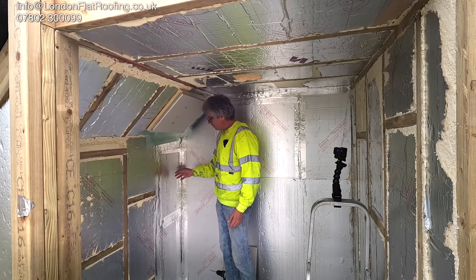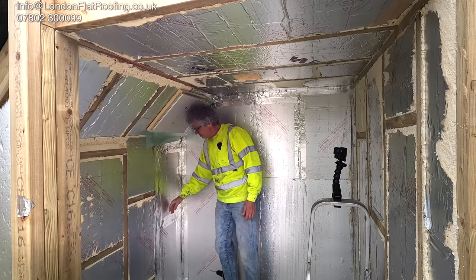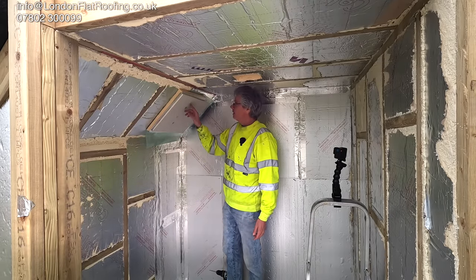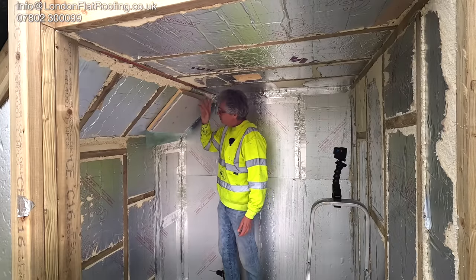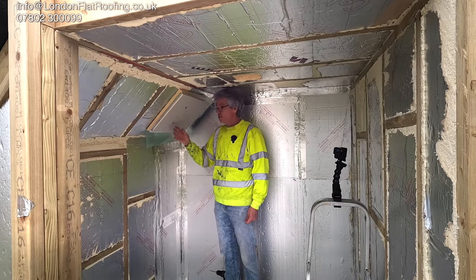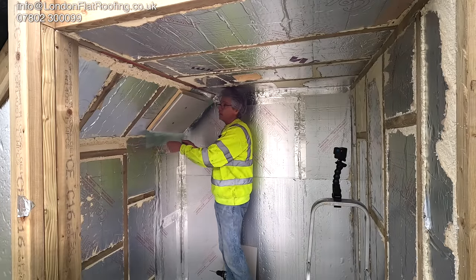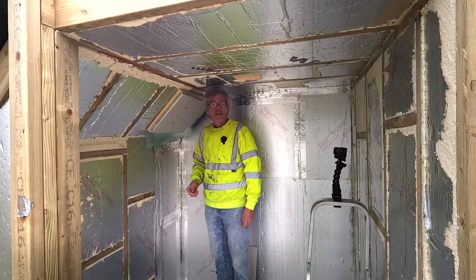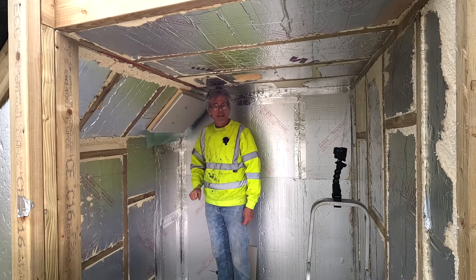There are too many problems with it. This was done two or three days ago and I'm seeing that this is still loosening in places all the way around — it's just not airtight. Now when I take this off, you'll see that there are screw holes going through breaking it, and that causes a problem with air movement as well. You'll see when I do the next video — which will have the vapour barrier continuous all the way around — how we get around that problem. So hopefully that's been helpful for everybody out there. If you've got problems with this kind of thing and you need more information, please get in touch.